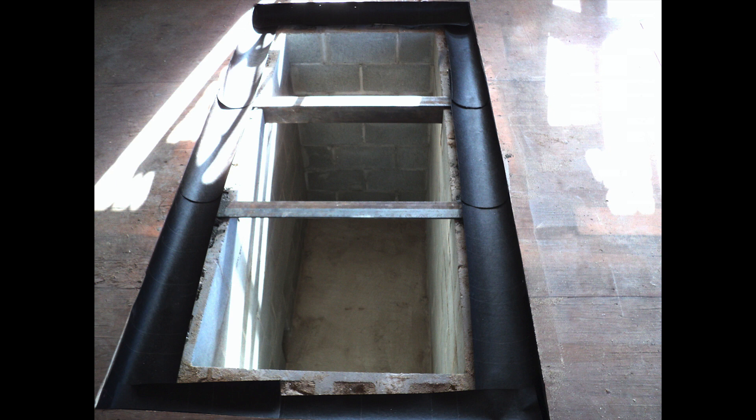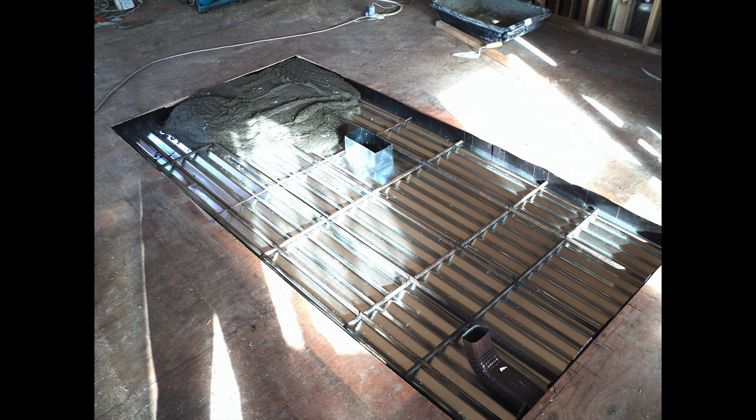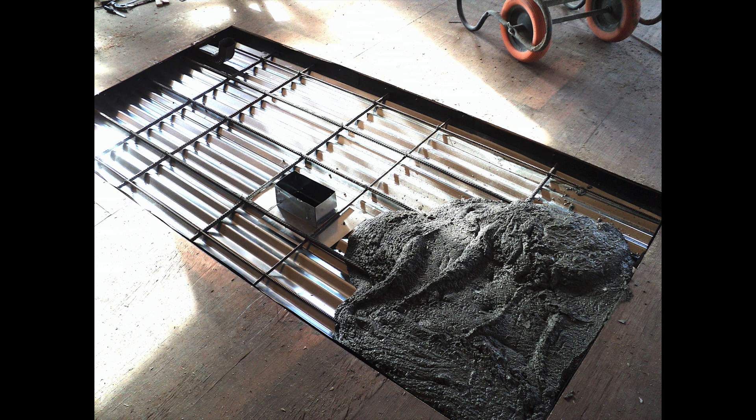The next steps didn't happen until the house was framed up and enclosed. The next step was to pour a reinforced concrete slab to cap the foundation. I placed some angle irons across and laid sheets of corrugated metal on top to hold the concrete while it hardened. I allowed for a fresh air intake and an ash dump where the firebox would be. Then I tied up the rebar and poured the concrete.